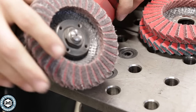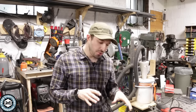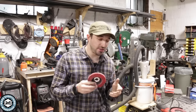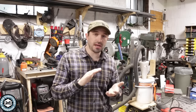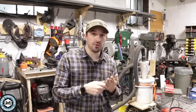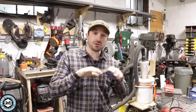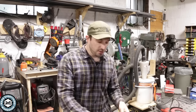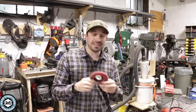I use these on the bike racks that I just finished, and these are how I was able to blend all the rough ground corners and rough ground joints to a really nice smooth finish before paint. A lot of times when I'm making a piece of furniture, I've got a flat weld on a corner and I want to grind that down efficiently and then prep it for paint right away. With a heavy flap disc, which does a great job removing the weld, it's going to leave pretty deep scratches. If I want to get those scratches out, I have to bring that base metal down — and by bringing the base metal down, you can introduce dips that at a high gloss level when painting you're going to see. So with something like this, you can creep up on that initial surface and also give yourself a really smooth finish with just one disc.